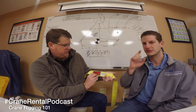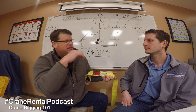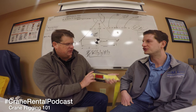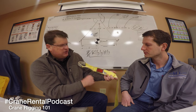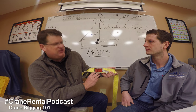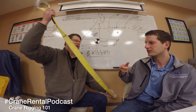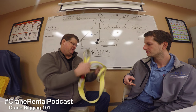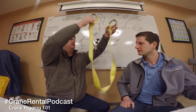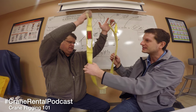You'll also have other information - they call it a CERT number or identification number for that specific sling. You'll notice this one is markered in, and it's per manufacturer. Here's the length: six foot. On a synthetic, it doesn't have to have the length, but manufacturers generally put it in there. This tag may slightly change brand to brand, but all this information has to be here. The only thing that doesn't have to be on a synthetic is the length.